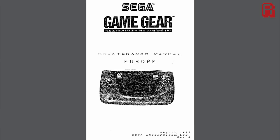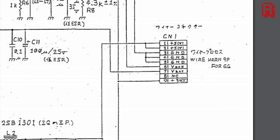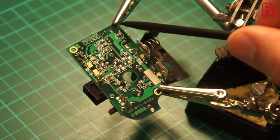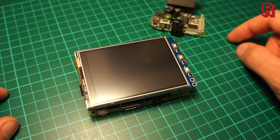This is the European manual — I can't imagine other regions will be much different, but do double check if you're going to attempt this. Inside we find the diagram for the power board and the pin outs. Very handily, pins one and two give us a 5 volt output and three and four give us a ground — and that is all we're interested in today. All the other pins are irrelevant to us, although there is a spare ground which we may find useful. From left to right the pins are: 5 volt, 5 volt, ground, ground, and the spare ground. We're ignoring the rest.